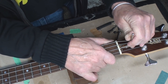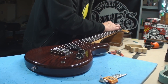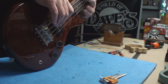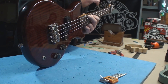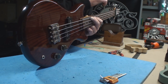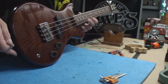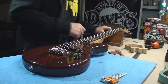Lose that much — that's probably going to do it. I've mentioned this before: loosening the truss rod when the strings are under tension is not going to hurt anything. Tightening it when the strings are under tension could spoil your lunch. So that to me is twelve thousandths of an inch — 0.012 inches, plus or minus 0.002 inches. Player preference, whatever you can get away with.